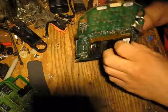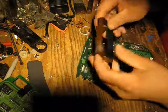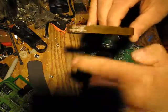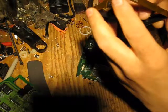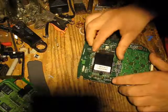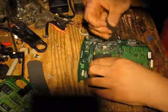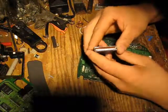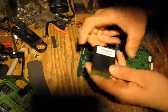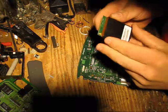It would create a short or something like that and erase the keys. We can just pull that off though. If you notice, there are little fine wires that loop back and forth in there. I'm guessing punching a hole in that would send a signal to this. Probably what this backup battery is for is to help be able to detect it with the power off. Here's the encryption module — it's epoxy-potted, so you'd have a hard time getting this thing open.